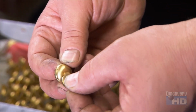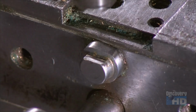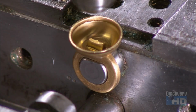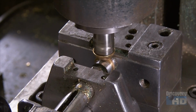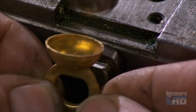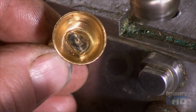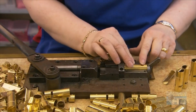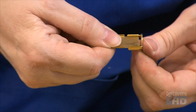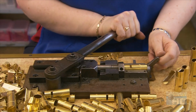They fit a loop onto an end cap. The loop will make the whistle easier to hang on to. A rotating press bends the loop's tab against the inside of the cap to fasten them together permanently. They attach an end cap to the slab, and then force the slab into the cavity of the whistle, splitting it into 2 chambers.